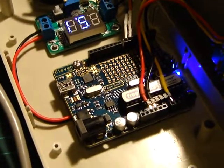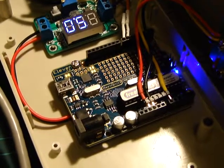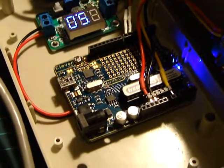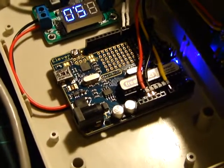The reason I'm using that is that from my experience, running 12 volts into an Arduino directly makes the thing really hot. I've done several projects with them in the past in boxes or inside racks, and you touch the box and think, that's not going to last too long with that heat.